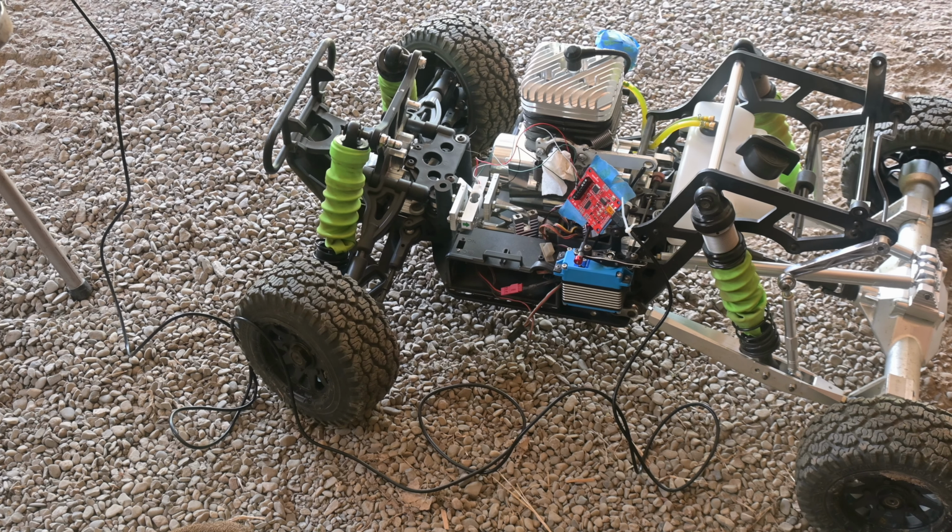So this is from the center position. I'm not leaning on the vehicle. This is sitting here on the gravel on its own. This will be going from center to left. 21.36 is what it took to get that to move over. That makes a huge difference when it's sitting on this little bit of surface. No wonder these servos struggle.